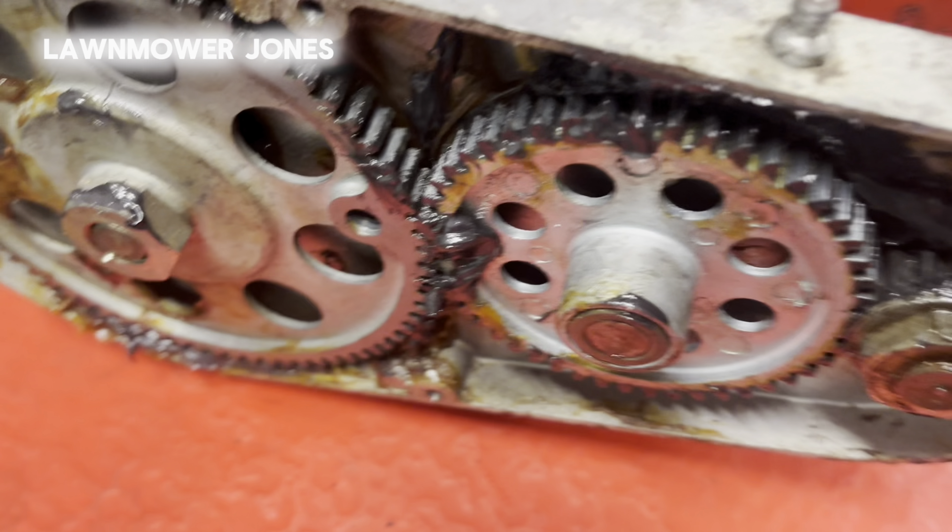The servicing is quite easy — it's more or less just greasing. We've got a few grease nipples: one on each side — you can probably see the one down there with a bit of red grease on it for the left-hand side, and the other one on the right-hand side. Then there's a little one on the gear case. And then we've got one on each roller — there's a little hole, there's the first one, and if we turn it a bit more there's another one. That greases the center parts of the roller. I always like to also put a little bit of oil on the axle where it goes into the side frames as well.